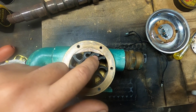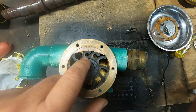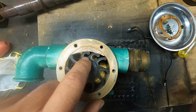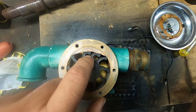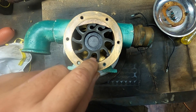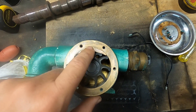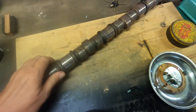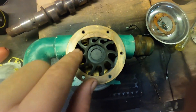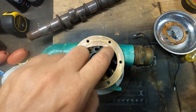Up here we have what's called the cam, and this actually bends those blades even more than they are down in the lower part of the housing. The effect of that extra bending changes the volume of the section between two blades. The volume of this little cavity here is much smaller than it is for one of these cavities where the blades aren't bent as much. So this changing of the volume of these sections is the job of the cam. This is an internal cam — cams you're probably more used to are like an external cam, whereas this is more of an internal cam. So you've got smooth round with a lobe here, smooth round with your lobe there.